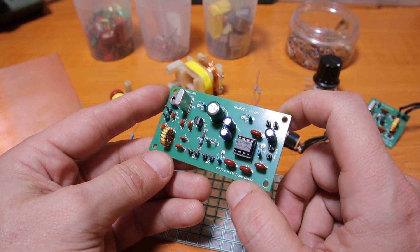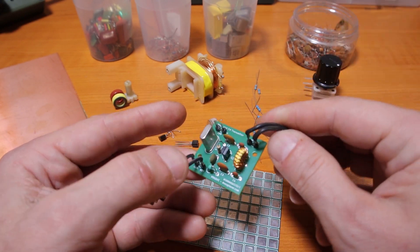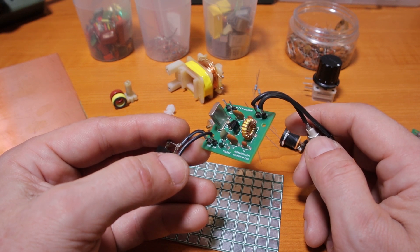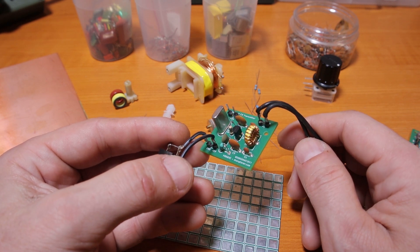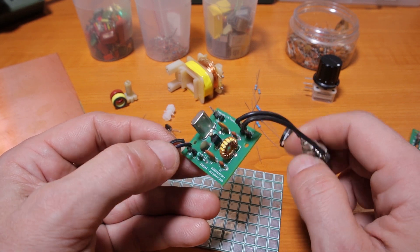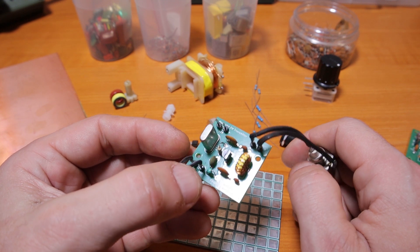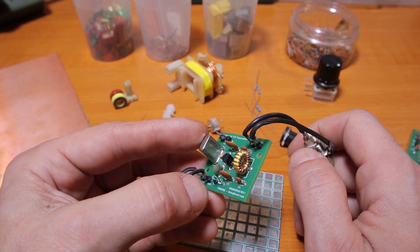It has about 700mW and I presented this one in an older article. I like it very much. Similar to that one is this CW transmitter — both of them use just one transistor, either a 2N2222A or a 2N3904, and both are around 700mW. The only disadvantage is that they have a fixed frequency.